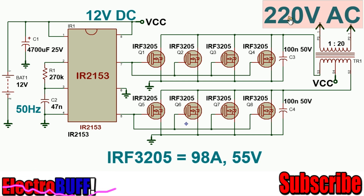If you want 120V output, reduce the ratio to 1:10. You can also replace the MOSFETs with the IRF1404, and in this case you will only need about 2 or 3 of those to generate 2000W.